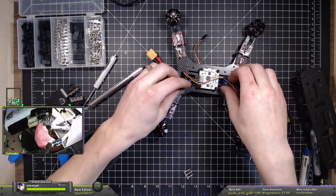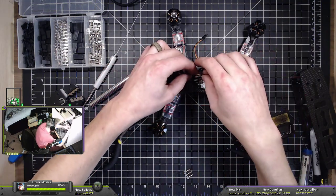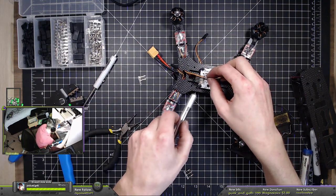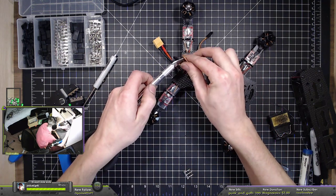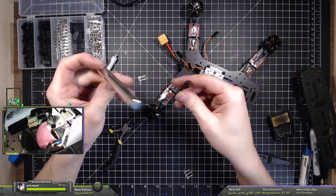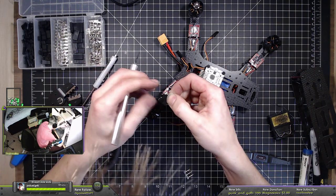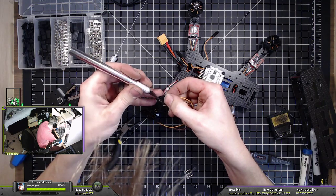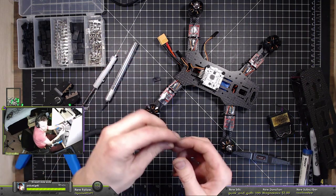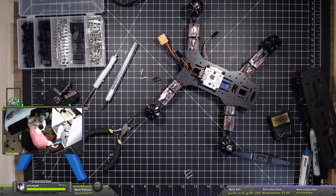Okay. So now we have one more to do. So that should be ESC number 1. This should be ESC number 2. So let's come over here. Trim these wires up. There we go. Depin these. There's that one. There's that one. Throw those away. Take these DuPonts. Throw that away.